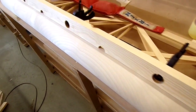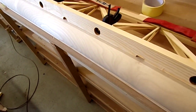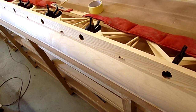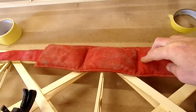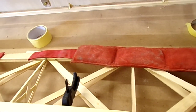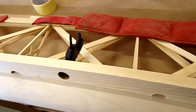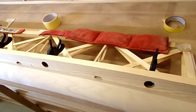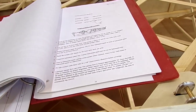It's amazing how much difference putting this piece of plywood does to the torsional rigidity of the aileron. I did a little deflection test with one of these bags on the corner of the aileron, locked in position beforehand, and then after putting the leading edge on temporarily and locking it again - this reduced the amount of twist for that given weight by sixty percent.